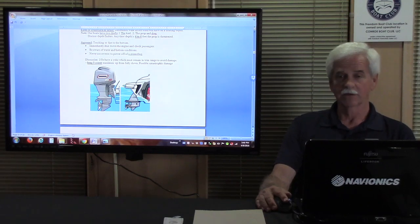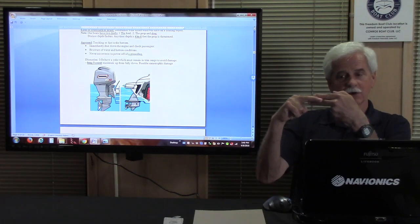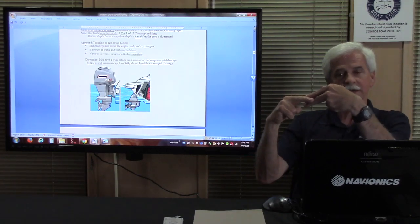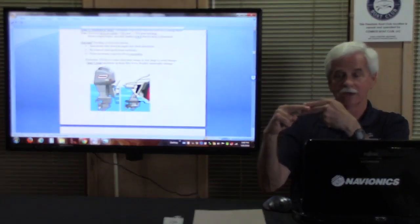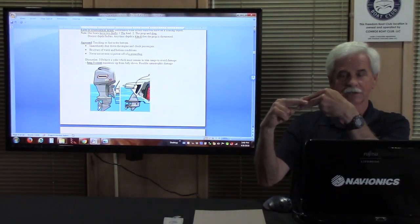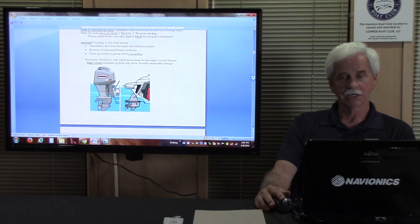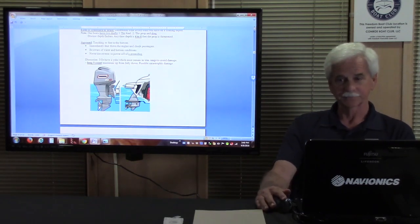On an inboard outboard we have the motor sitting right here, the outdrive right here, and right in between the two of them, going through the transom, is a spinning yoke that allows the motor to turn, and it allows it to trim, and it also allows it to tilt all the way up to the trailering range. And as I said, a marine engine will not shut down for any reason. You'll exceed the range of that yoke, crack it, bust it loose, and you'll have a 10-pound hammer swinging, tearing out the back of the boat, catastrophic failure up to and including sinking the boat on the spot. An FBC Plus plan would look real good right about there.